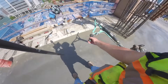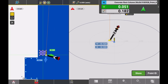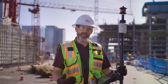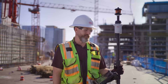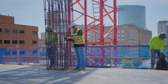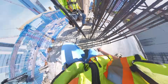As I'm going around and laying out points, I don't have to really plumb the rod. As long as I can just take that tip and move it around and read the data from the screen, I can be on point. There are going to be a lot of obstructions in the way — it could be people, formwork, or rebar. But with the option to just raise your rod up or lean the pole from side to side to get around those objects, you don't have to wait for someone to get out of the way, you don't have to move material — you can just get right to your point when you need it.